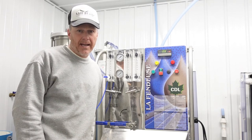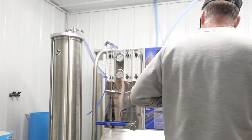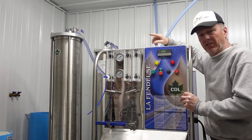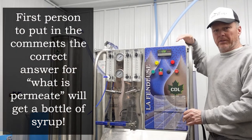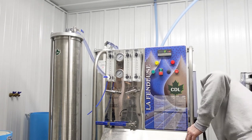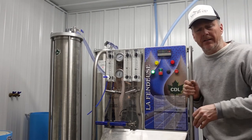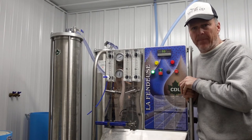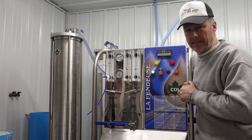As always, if you guys like what you're seeing, give us a thumbs up. Part of our wash cycle includes recirculating the water through the machine and through our hoses. Once that is done, we clean all the soap out using permeate that we make here on the farm. We're going to dump it and start the machine. The green light is on — we'll wait approximately 12 minutes, which will push 200 gallons through both of our hoses. At that point we're ready to put the new membrane in and begin the reverse osmosis process on our next batch of water.